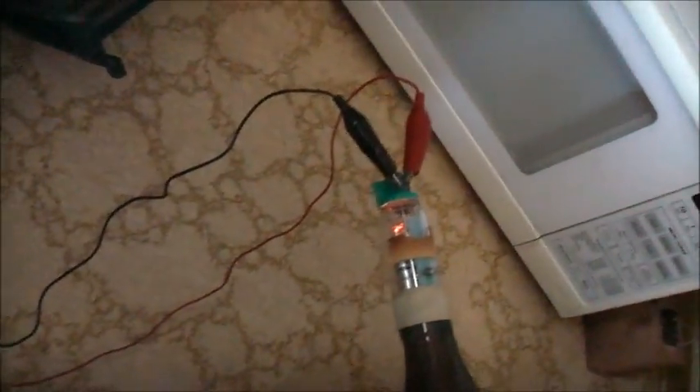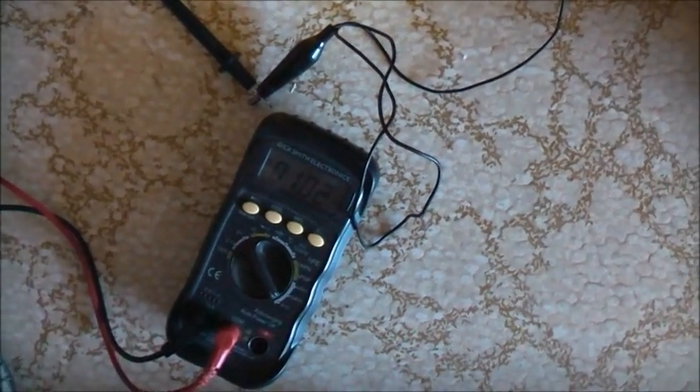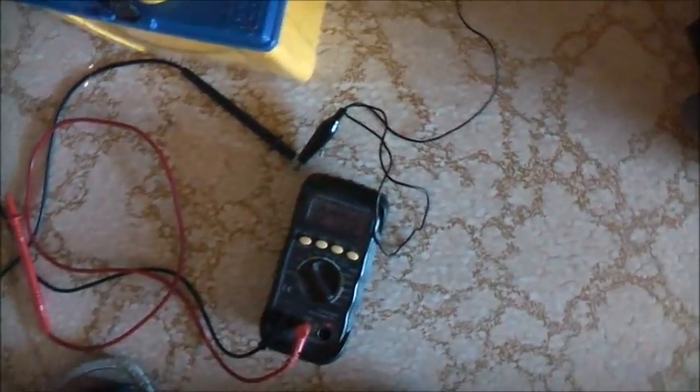They're pretty warm. Before I run any experiments, I'm going to put the multimeter on here and see how much current those heaters draw, just out of curiosity. Let's connect the multimeter. Okay, they're on. There we go — one amp, just over an amp. That's what the heaters consume. Alright. Before I turn this thing on, I'm going to hook up an earth lead and a discharge lead for safety.